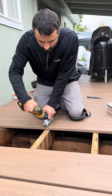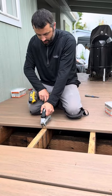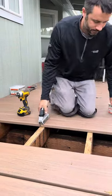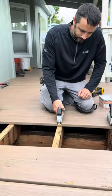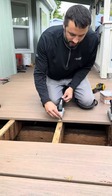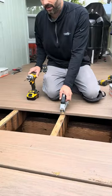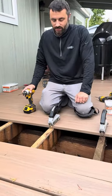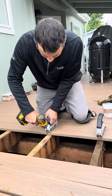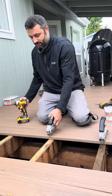Make sure your deck tool is tight, then run the screw until it bottoms out. Switch to the back side and do the same thing. Grab the spring-loaded mechanism and move to the next joist. Drop in two of these screws — they're made for exterior use and for decking, so they're rated for pressure treated materials. At 2-3/8 inches, they'll penetrate just perfectly.